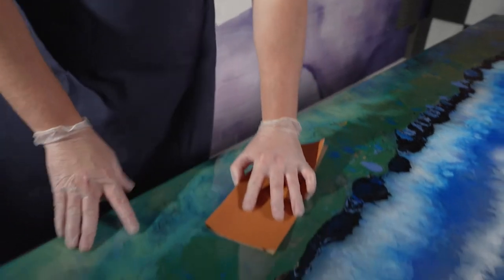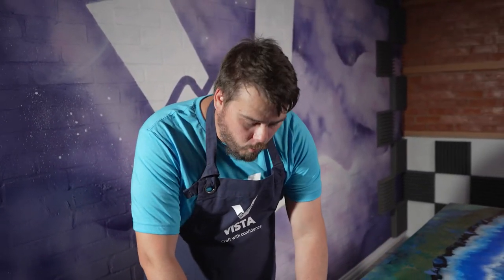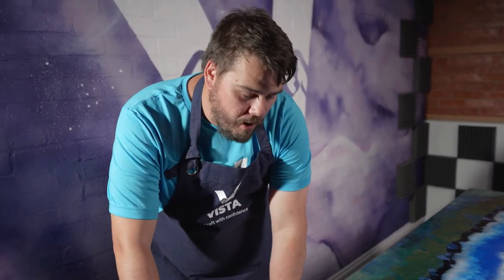We're going to get the table quick sanded, we're going to clean it down, and we're going to roll on the Duraceal. We're going to give this table a quick sand down with some fine grit sandpaper. We're not going to press too hard — we don't want to put too much into it. The sealer is going to take out any shallow grooves, but anything too deep is possibly going to show through, so we're just giving it a nice gentle once over with the sandpaper.